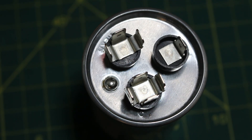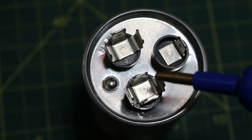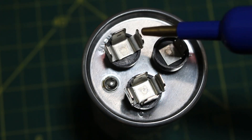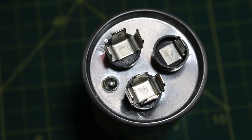Here's a real-life scenario — sometimes you'll encounter a dual capacitor so severely rusted you can't actually read the terminal labels. One thing to notice is that the Common terminal has the most points of connection: one, two, three, four points. The one with the most points of connection is always going to be your Common. Your HERM terminal has three points of connection compared to your FAN terminal, which only has one. That is how you differentiate the HERM terminal and the FAN terminal.